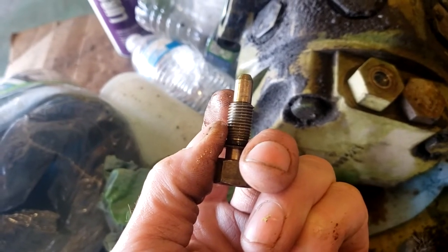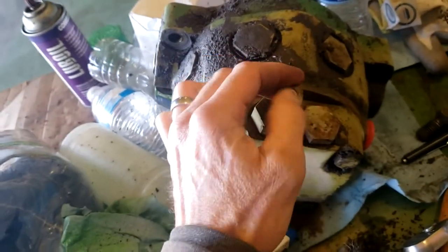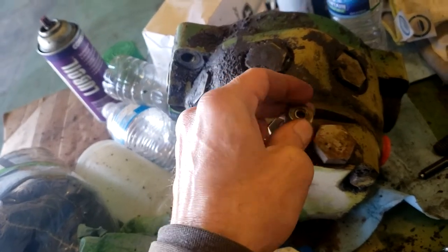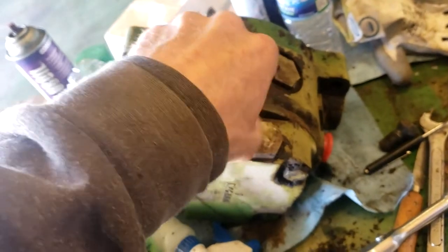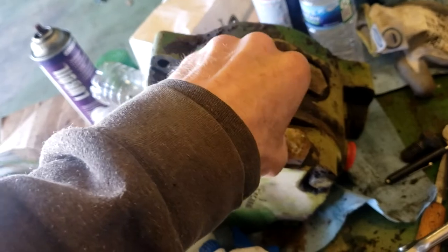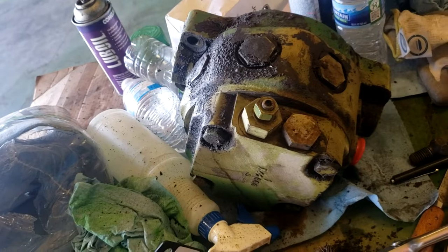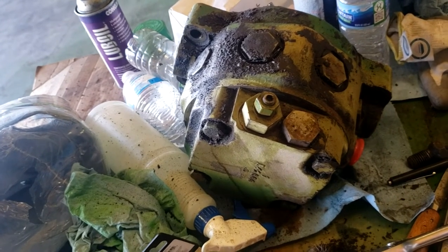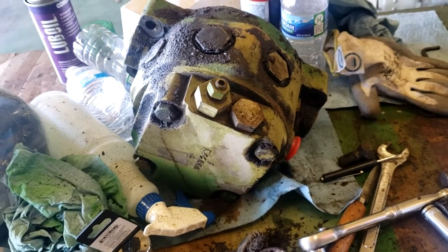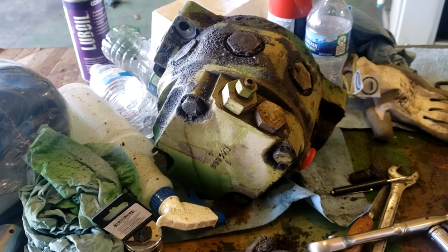And so now what I need to do is get set up, get my pressure gauge hooked up to the tractor, and I'm going to start it and check to see where hydraulic pressure is. Then at a high idle, like 1000 RPMs, I'm going to make any assessments or adjustments from there. So I'll get that started.